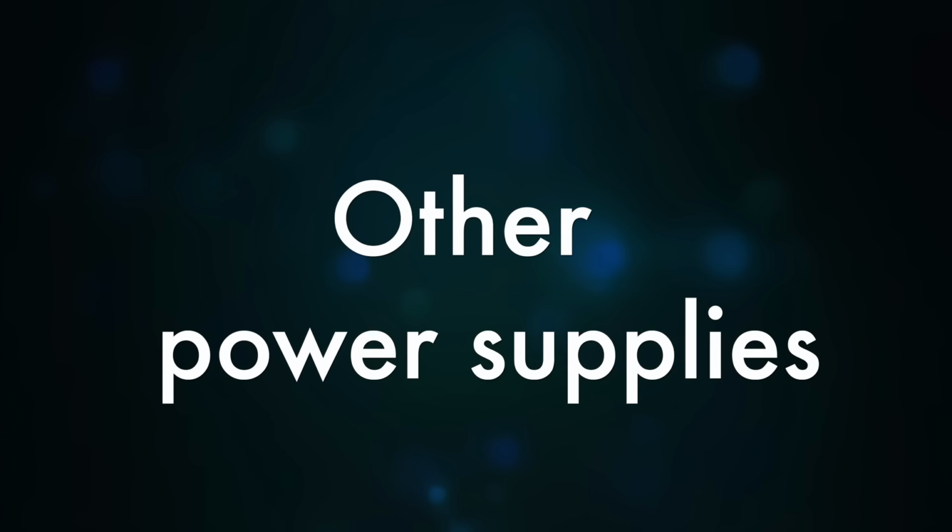And the efficiency varies between 55 and 65%. Furthermore, a transformer is relatively slow and therefore needs buffering in the form of large capacitors. Good audio grade capacitors with sufficient capacitance also come at a price. The advantage is that there is no switching noise.